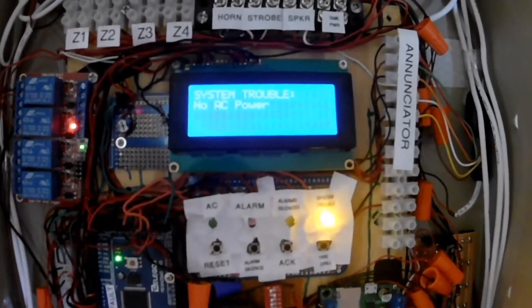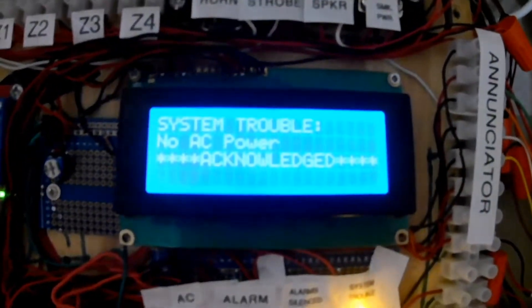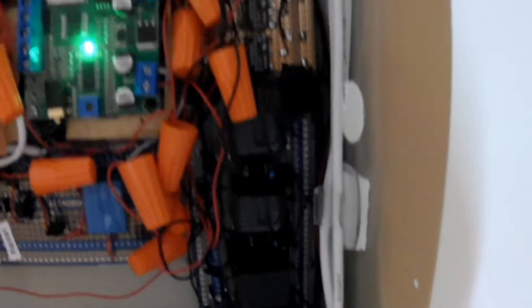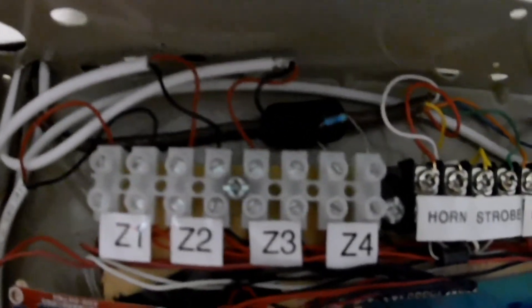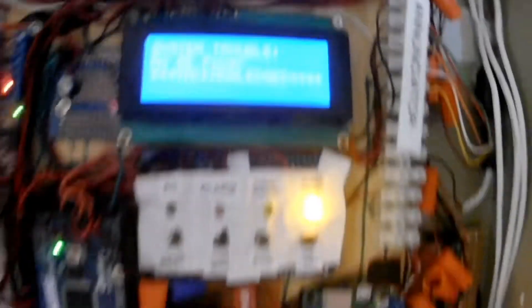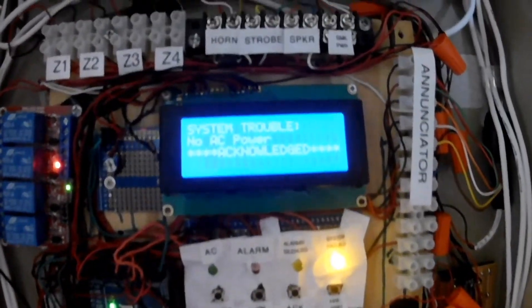Since I was redesigning this panel, the piezos are broke, so there's no piezos on this thing. There's zone supervision — one of them takes a 3.3K ohm, and then one takes a 4.7K ohm. So yeah, there is power supervision and zone supervision, and there's a little AC fault indicator right down here on the board as well.